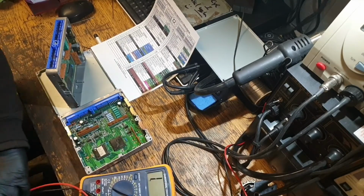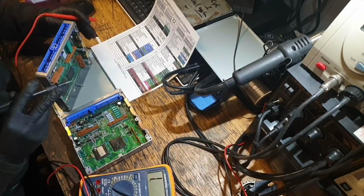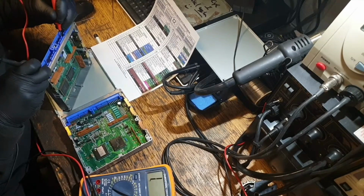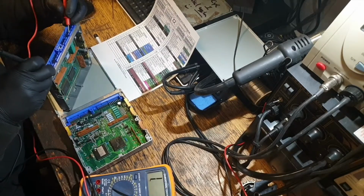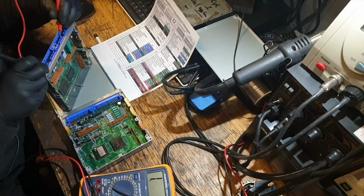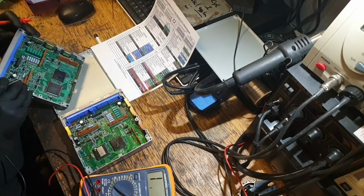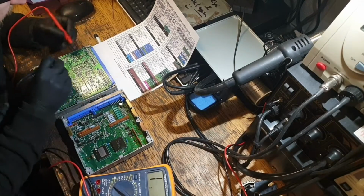Set it on a fairly high resistance setting. Is it chassis ground? I think it is. Open circuit. Open circuit. Open circuit. Well, that doesn't bode well. Leads are connected. So where do I go from there? They are the right pins. Certain of that. Much slightly higher. Well, that was inconclusive. I'll go straight to them. I haven't got an LCR meter then.